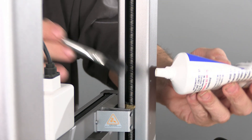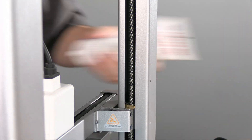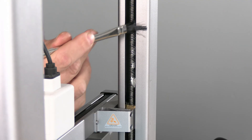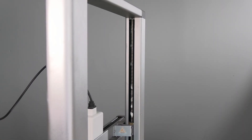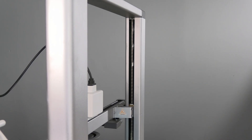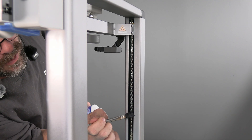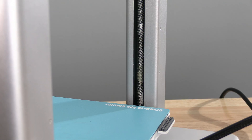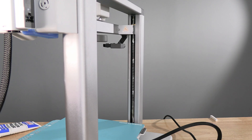The reason we are doing this near the tool head is because this lead screw has a lot of play down here at the tool head where the lead screw is coming out of this fitting — there is very little play, and you can work with it with less risk of damage. With your A1 all the way down, put some of this grease on your paintbrush — of course you can simply use the bottle, but the paintbrush makes it easy. Just dab some grease every inch or so, then use the screen and ride it all the way up. Go ahead and catch those bare spots, all the way down to the bottom. You may be inclined to spend less attention all the way at the bottom, but guess where your tool head is going to spend most of its time. Do this on both sides and then ride that tool head all the way down.